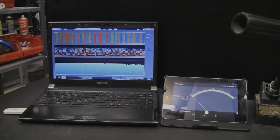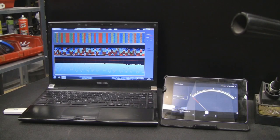To end the video, I've got the spectrum analyzer running on the laptop. As you can see, the amount of red coming from this jammer is blocking the complete Wi-Fi spectrum — channels 1 to 12 — with the signals bouncing up and down at the bottom. On my tablet I've got a little program called Wi-Fi Signal Analyzer, and at the minute the needle is at zero — it normally has a pinging sound when it picks up a signal from my router, but because the jammer is running it's not picking up any signal. I'll just turn the jammer off and you should see it connect again.